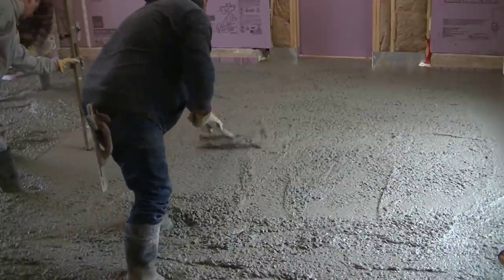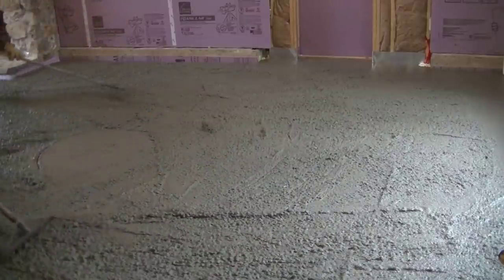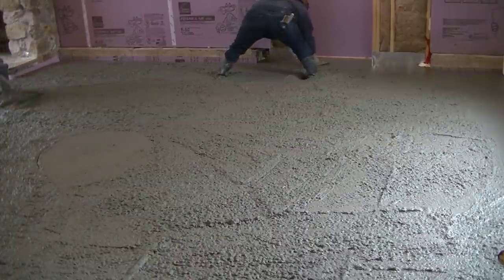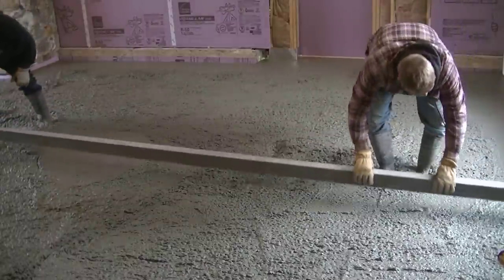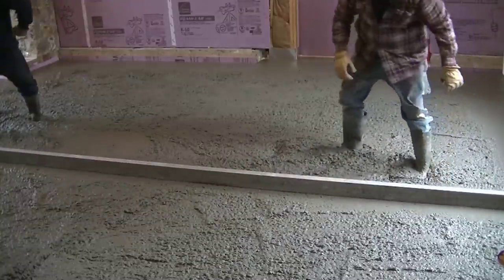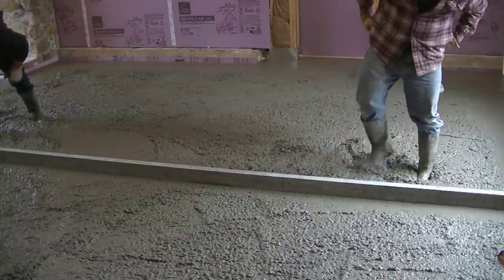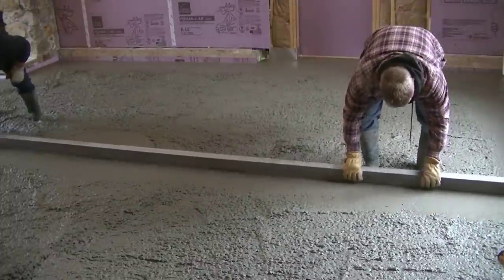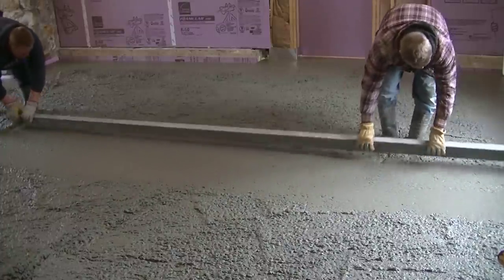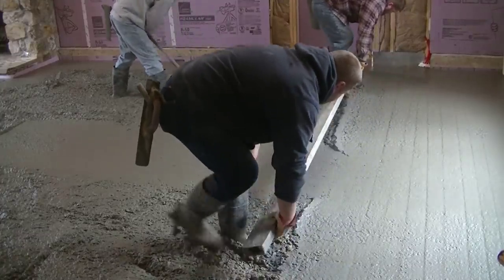Now I'm shooting my wet pad in the middle. The wet pad is what we use to screed off from — you'll see us screeding the pad and then using that pad in the center along with the edges that we mag floated around the outside. Luke's doing that over there. We actually got a blue chalk line around the outside edge that we're magging our edges to. This is what happens when the concrete's too low in the middle — the screed guy has to kick some in because there's no rake guy there.